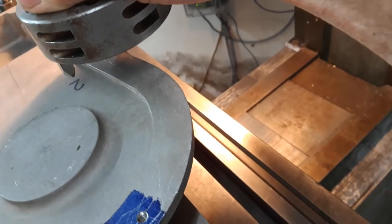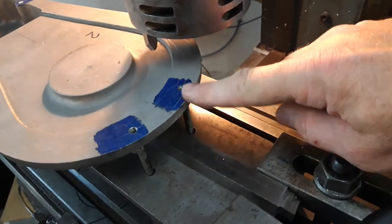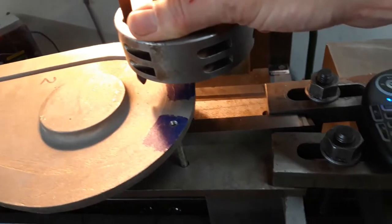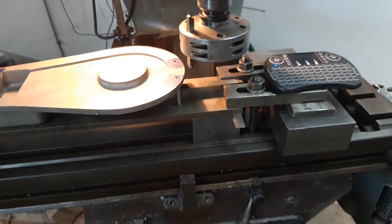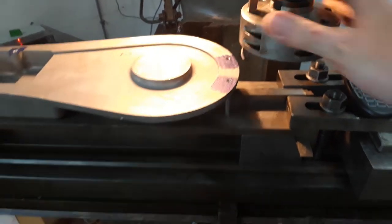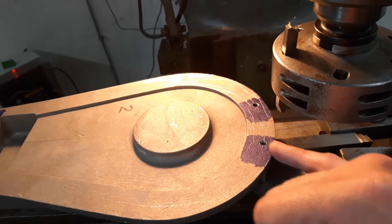So I'm well inside there. I'm going to make sure that I cut absolutely everything off when I do a skim of this piece. And the last thing I want to do is to exit the cutting tool away from the job before I raise it — make sure that it has come all the way off the end of the job.